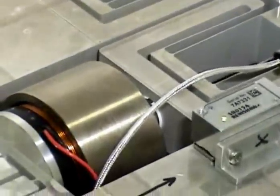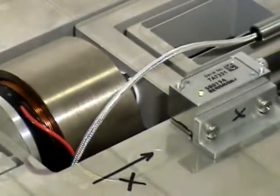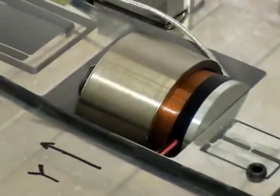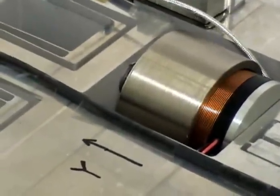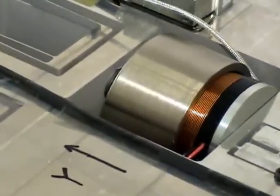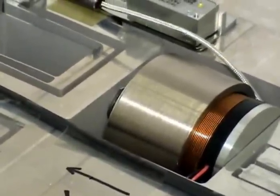This view shows a close-up of the X actuator. Both actuators in the system are non-contact voice coil actuators. The coils are attached to the ground in both cases, while the permanent magnet is attached to stage 1 in the case of the X actuator, and to stage 2 in the case of the Y actuator.